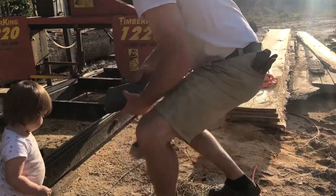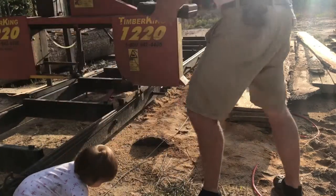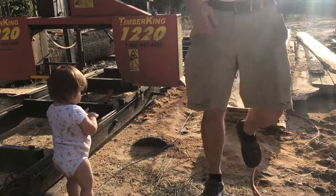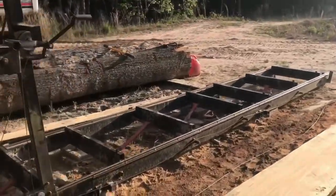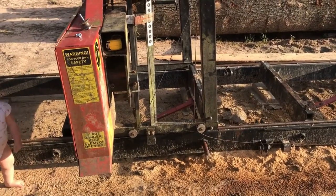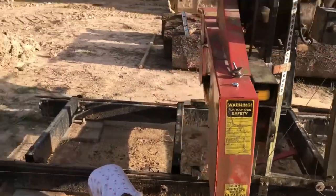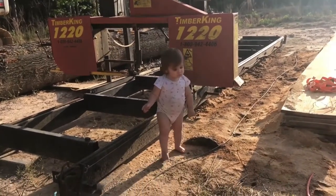Actually, I've got to go to the other end and let the tension off of it first. I'm gonna go down here to the far end. It's important to note the way this cable runs if you're new to this, or else you might get confused, so you might write down which way you're gonna go with it. It goes up off that left-hand pulley, around the back side of the top pulley, and then basically straight down through the right-hand pulley. That's what makes it work when you crank the handle — it walks. If you run the cable wrong, it won't walk the mill correctly.